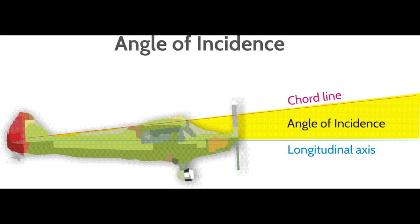We've got a rod that runs the entire length of the wing cord through the 3/16 holes in the spars, and we push that through the quarter-inch holes on the attachment fittings. Now we've got a loose fitting but it's held in place. At that point we're trying to match the angle of incidence — the wing moves a little because of the play with that 3/16 rod through those quarter-inch holes. Once we get the angle of incidence right, we clamp it in with vice grips through the attachment fittings. Then we drill: the front hole has to be drilled to 3/8 inch (AN6) and the rear hole needs to be drilled to 5/16 inch (AN5).